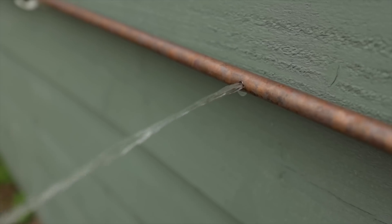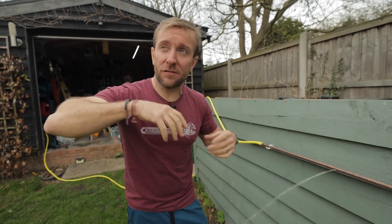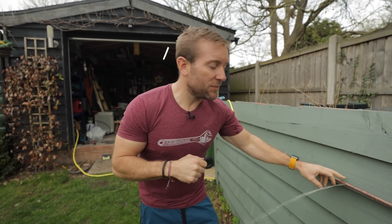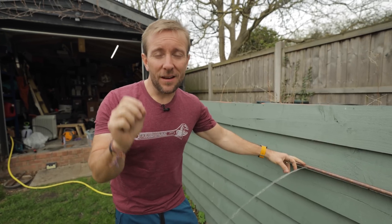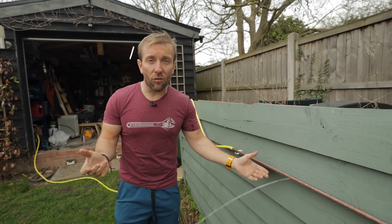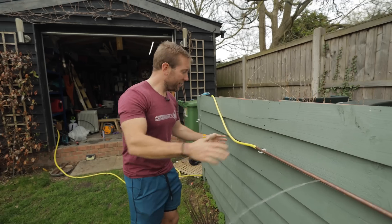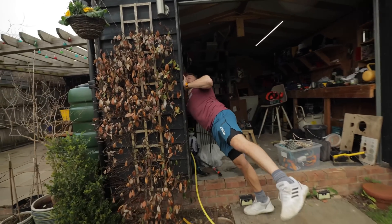The first thing you should do is get in control of the situation. You've got water coming out because the pipe is frozen. When water freezes it expands — it's the point at which it goes from being a liquid to a solid, the point of expansion — and that is what will rupture a copper pipe or other types of pipe not designed to be outside and frozen. So the first thing you need to do is just turn the water off, get control of the situation. For our demonstration here, I'm going to trace my hose all the way back to the tap and turn it off.